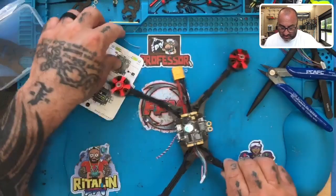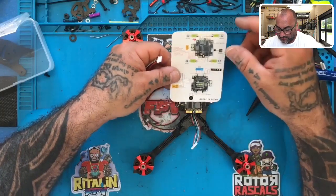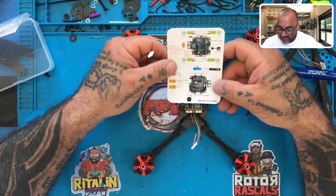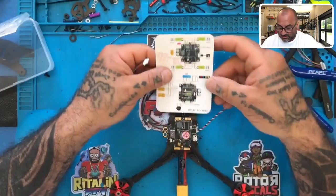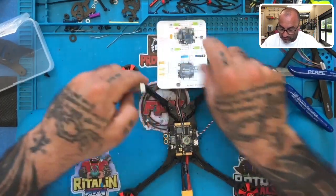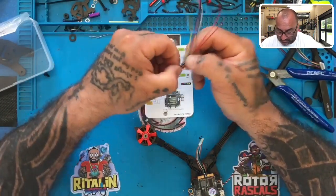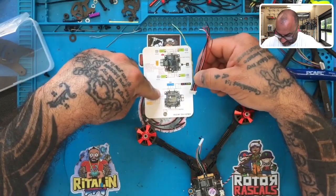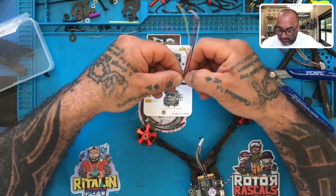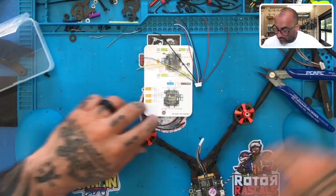The next thing is going to be our camera, which is coming out of the front, okay? So if you look at the front, this is going to be sitting like this, so to speak. And so what we have is our front here, and we're looking for the wire harness here that is going to fit the wire diagram. So we have that we see right here. It's going to have a LED, a 5 volt and a ground. Let's see, that's got a RX TX, and then let's look at our other wire harness, which is right here.